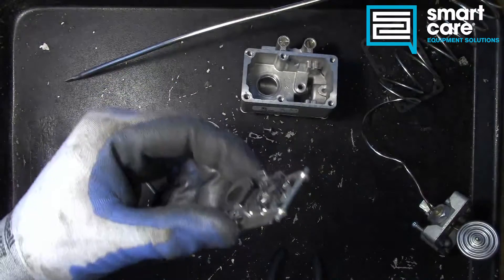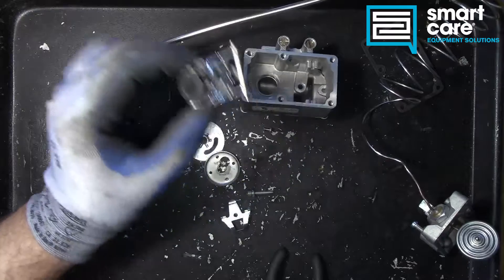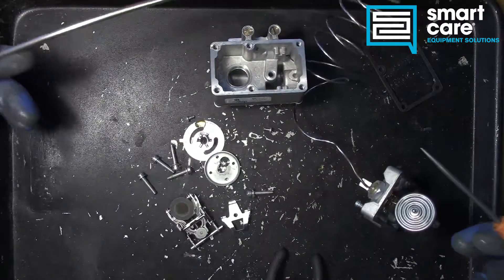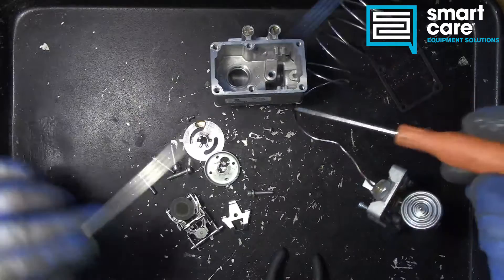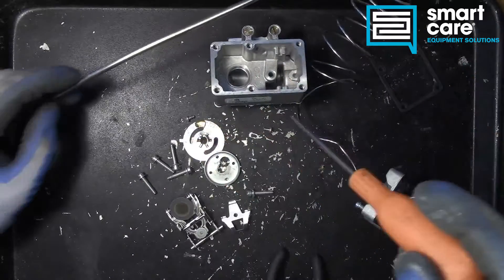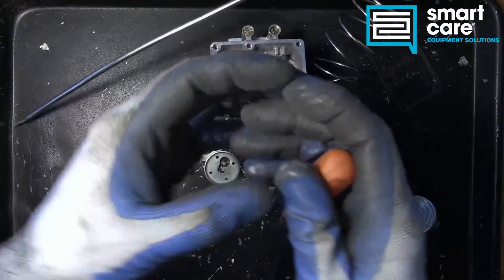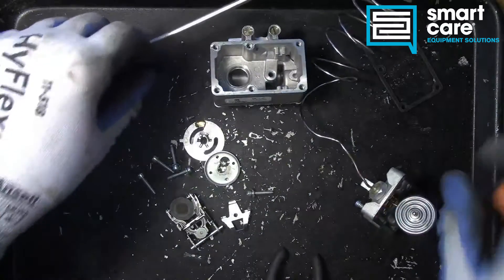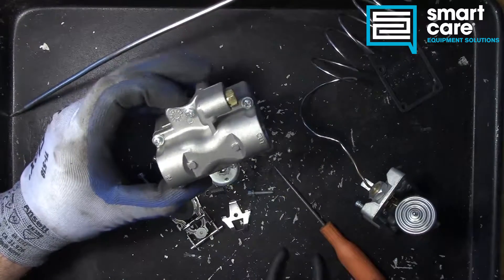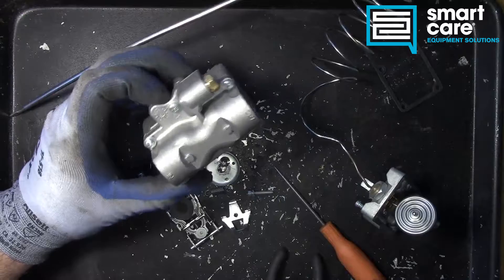That's the upper part of the valve — we have this intricate little spring mechanism pushed on by the little hydraulic bellows assembly. And it's worth mentioning again that this capillary tube and bulb system has a fluid in it. As it's heated up, that fluid expands and puts more pressure into the bellows. Now let's open up the bottom half and follow the gas passages through the rest of the valve.